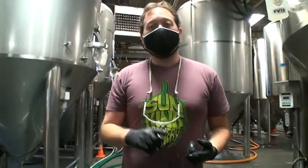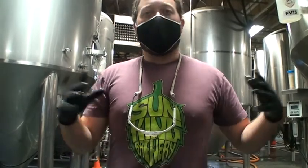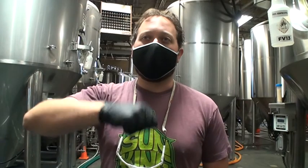A good tip about isopropyl: isopropyl alcohol will shatter acrylic. So if you ever have anything that's a hard plastic or acrylic plastic, do not use isopropyl alcohol — it'll break it down and crack it. Pretty quickly. A good example is the auto-siphons for homebrewing — there's a pump you put into the carboy. There's an acrylic part; you spray isopropyl and it'll start cracking and shatter eventually. You'll notice cracks almost immediately. Isopropyl basically dries out plastic super fast.